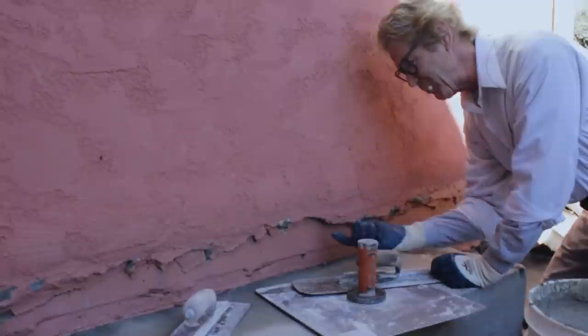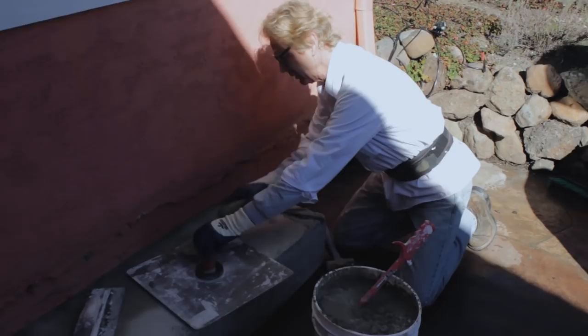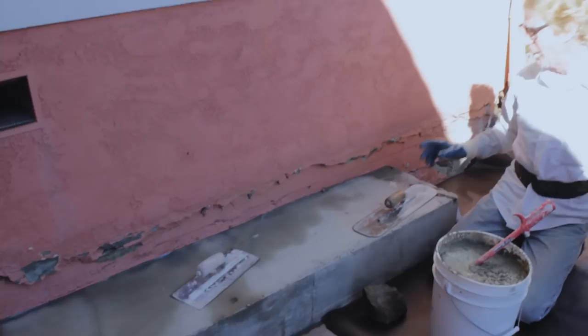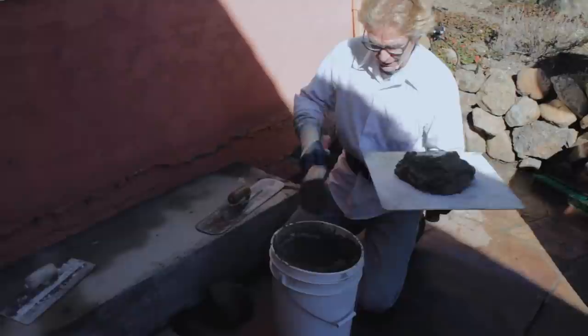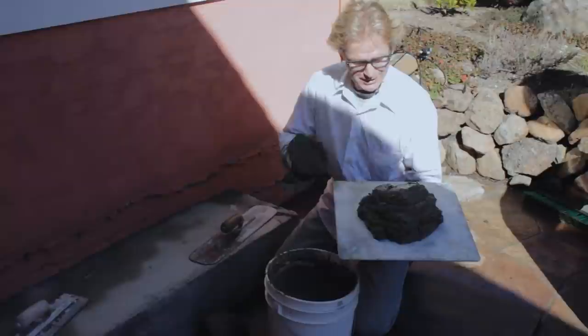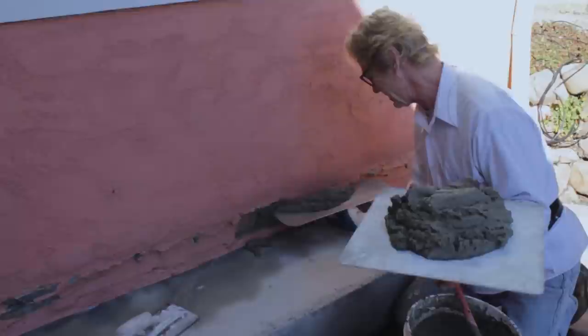Here's what you folks need to remember: under here is a lip — there's a big lip. So when I hosed it off and wire brushed it, I made sure to get my bonding agent under this lip. That blue stuff is just the bonding agent. We're tying in rocks so I put a little extra wire there. Number one: when you apply it, you want to squeeze it under there. That's the most important part, because throughout this area it'll just keep dropping. We don't want that. I think this is the five-minute mud.